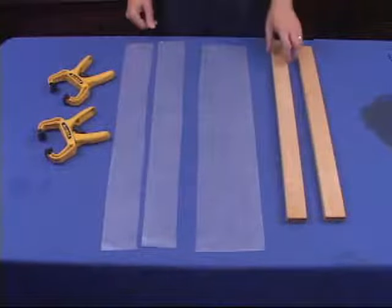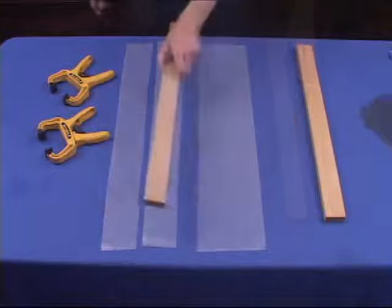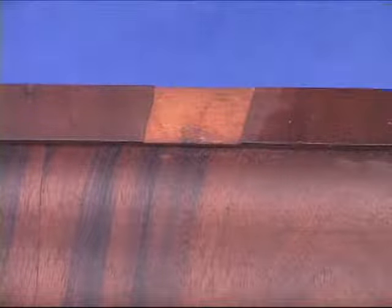For the next step we need two boards with approximately the same length as our strip. The reason we need the thinner strips is because they need to be as long as our clamp is holding the loose veneer. We need to address a third area — we're going to have to put a patch of veneer in here, but our lines are crooked and not straight.